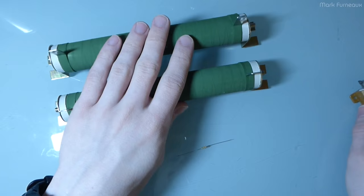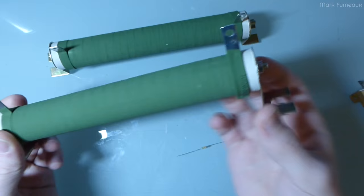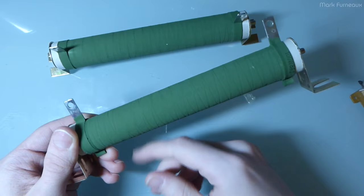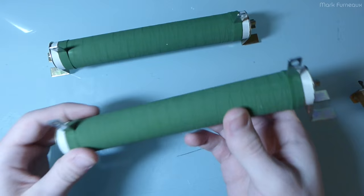These are kind of an expensive type of resistor — a ceramic tube. In this case there's just a threaded rod that goes through them with some metal angle brackets so you can mount it to something. It's basically just a metal strip wound around the tube with two terminals. These are supposedly marketed as non-inductive, but of course they have some inductance — it's just not terribly high.